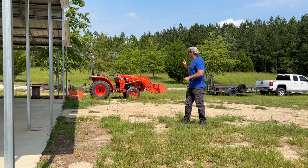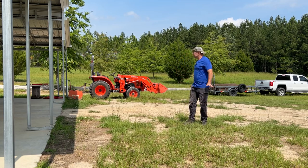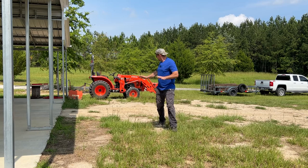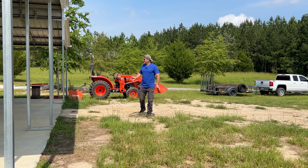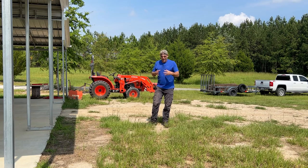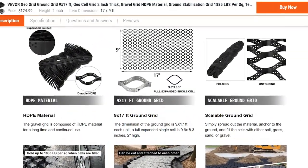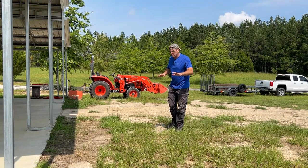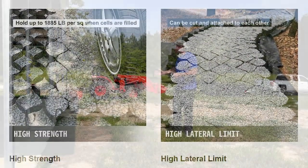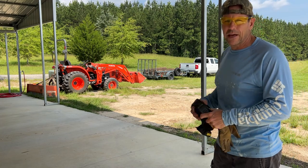What I want to do today is come in here with the box blade on the L3901, and also have the excavator - warming up in the background - to carve this out so it has a consistent slope coming from the concrete down to where it will be gravel. My thought process is this is on a slope, and as I'm pulling things in and out of the mega shed I'll slip on loose gravel. So we're going to put down this geocell landscaping fabric - it creates pockets about four inches in diameter. It's a nine by seventeen sheet and two inches tall, and it holds gravel in place. I'm going to put three sheets across the front of the shed where I think the tires might slip the most. We're going to start with the box blade, but I think it's going to be too packed and I'll have to grab the excavator and grub it out first.